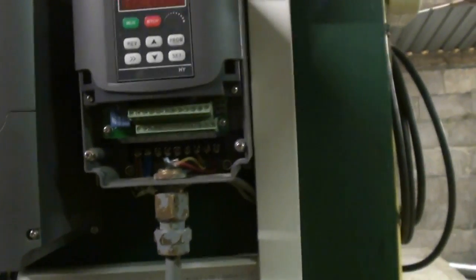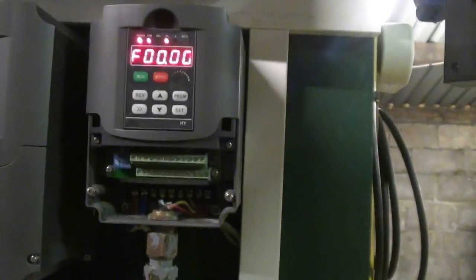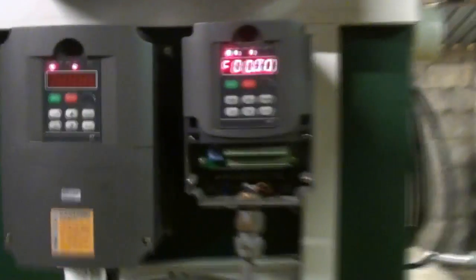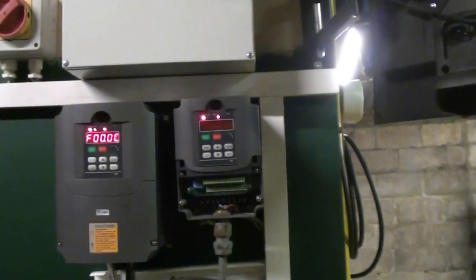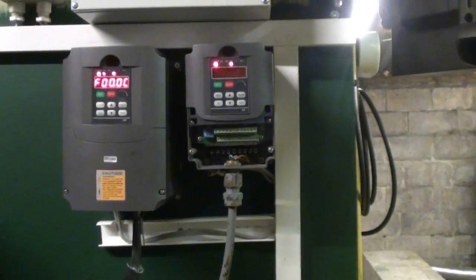We've got them both wired in now. In the long run I'd like to be able to connect the control into the computer, so when you start a run — you turn the dyno on — the water pump would ramp up because you want that running all the time. And you want the extractor maybe at 20 to 25 hertz just taking the exhaust away at idle, but not making excessive noise and using power. It would be quite cool if pressing the go button on the dyno to start a run automatically ramped the VFD up to full power, and then say 10 seconds after the run, ramp back down to 20 hertz. But that's something to look at in the future.